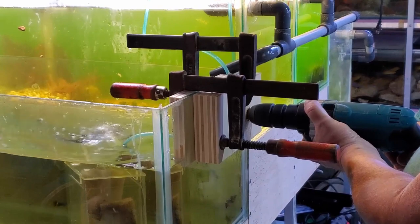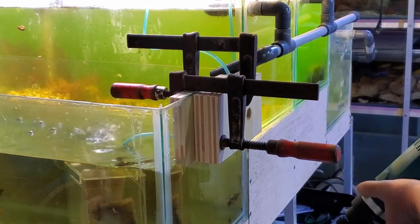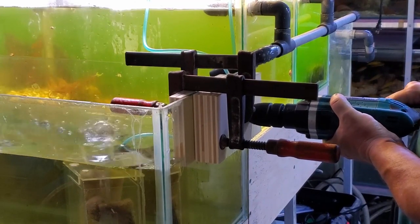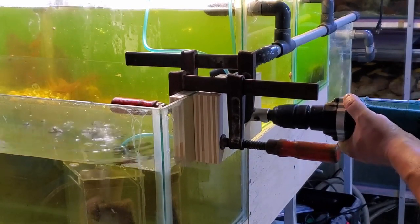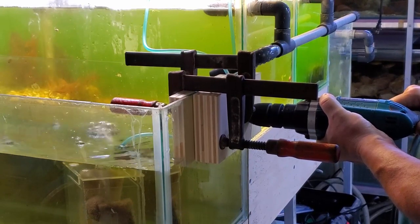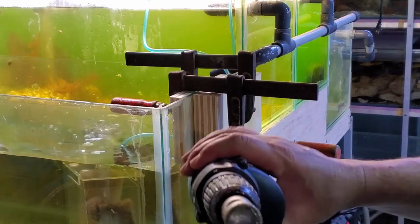One of the things I noticed while doing this: it actually wasn't hard to hold the drill in place. As you can see, it's quite steady and it didn't wobble much. This drill bit is... well, I'm kind of spoiled with some of the materials I get to use. But this is a relatively new thing that I bought, and compared to what used to be available from non-Orient-made things, they're a higher quality — it's just night and day. Anyway, you just push pressure on and take it out, let it cool, and go back and forth until you end up with a nice little core.